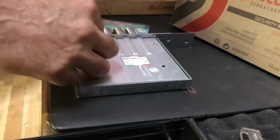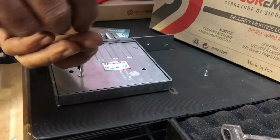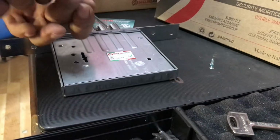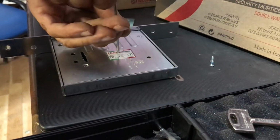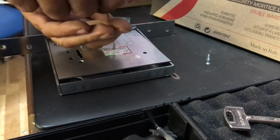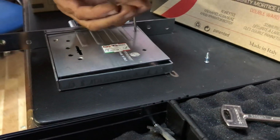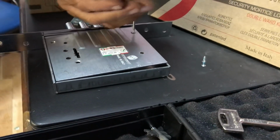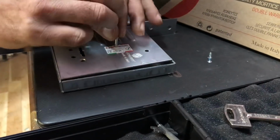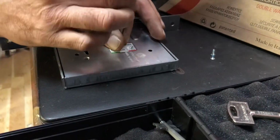So this is a SECURMAP system, a new system, where the SECURMAP factory has taken precautions against usual locksmith tools known as Grimaldello Bulgaro and also as magic key. On those tools, the procedure is not successful. Only a few locks I have been able to open with those devices, but very difficult. And I will show the new system, automatic lock impressioning system, which is created for those new modern double bit locks.